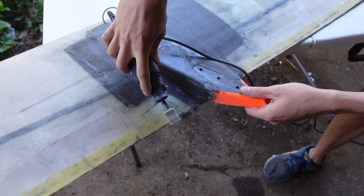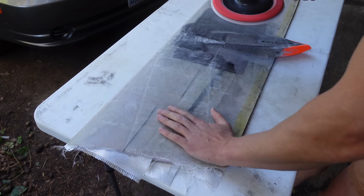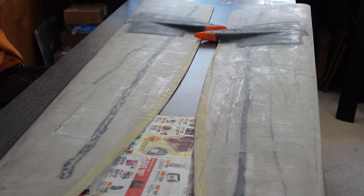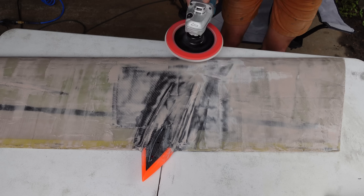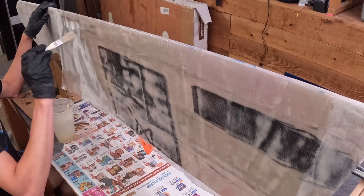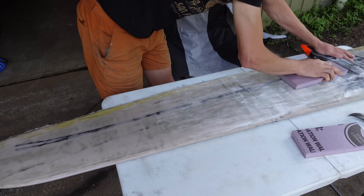With all of this composite work comes a lot of sanding. This is one of the downsides to laying composite over the top of a positive form as opposed to using a negative mold where the surface finish comes out near perfect. The surface finish was not bad but not great due to all the fabric edges, so I smeared on some fairing compound to hopefully improve the hydrodynamics, and then of course with that comes more sanding. Finally I added a layer of two ounce glass as a kind of surfacing veil — probably not super necessary, but it will improve the surface finish a bit.